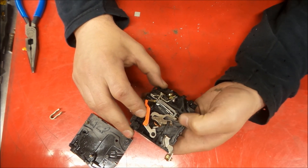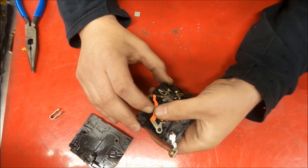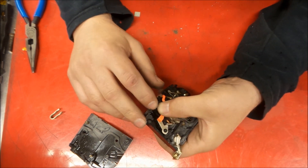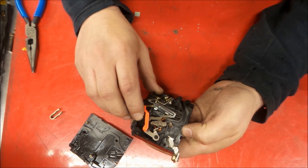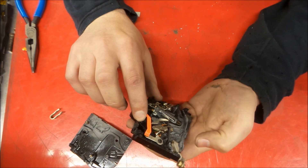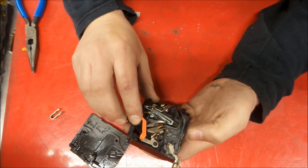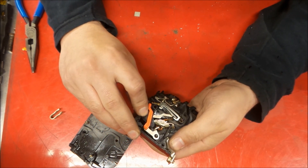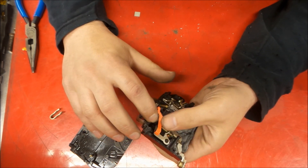You saw that open up our contact, and we got our red light here to show up. So now to reset that, we go to the off position and you'll see this pawl catch here — that's off — and then we can turn this back on, just like that. What I did to get this to work was I actually just adjusted this screw.